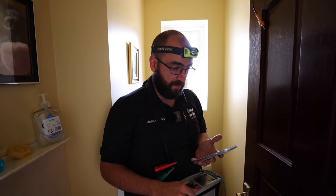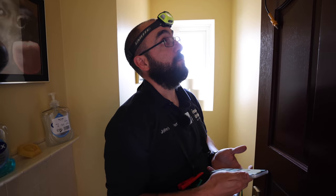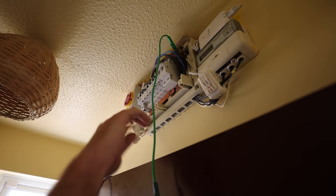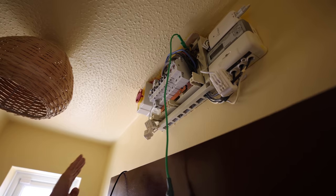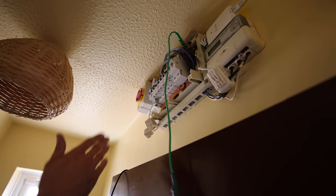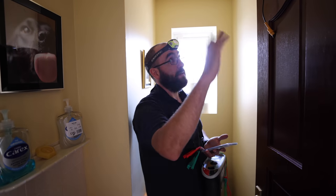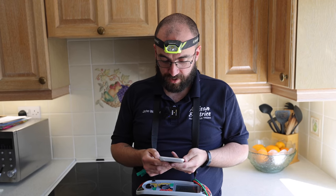Question from Matt Wolford: best tips for speeding up R1/R2. If you have permission to turn all the electricity off, once I've identified the circuits I go from the earth onto the bus bar, then turn all the MCBs on except for the rings. Now you've got R1 and R2 linked out and you can confirm circuits by turning them on and off rather than moving the lead each and every time onto each circuit. It's not always practical if you can't get permission to turn everything off.